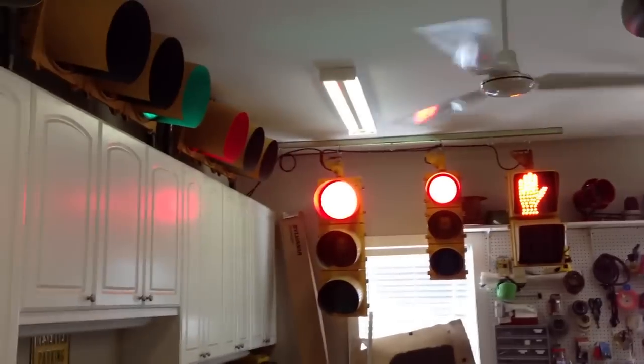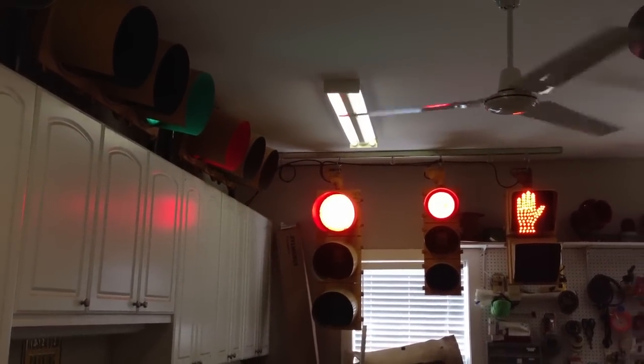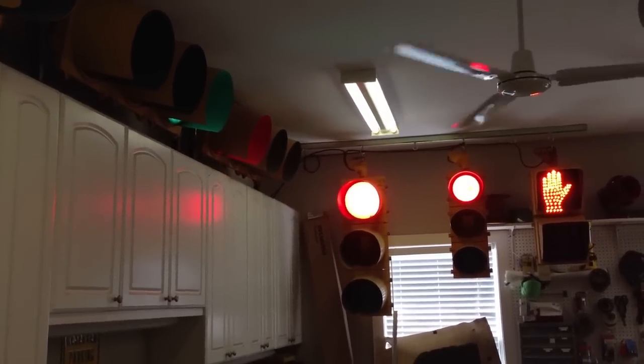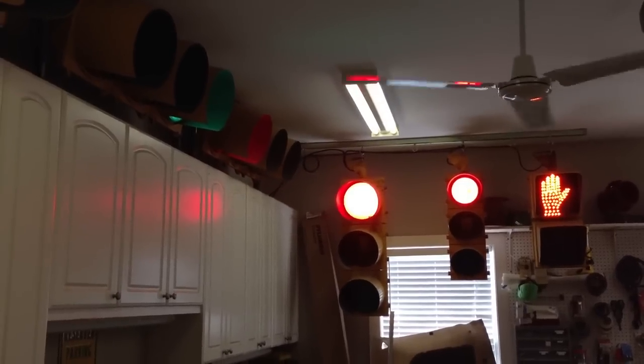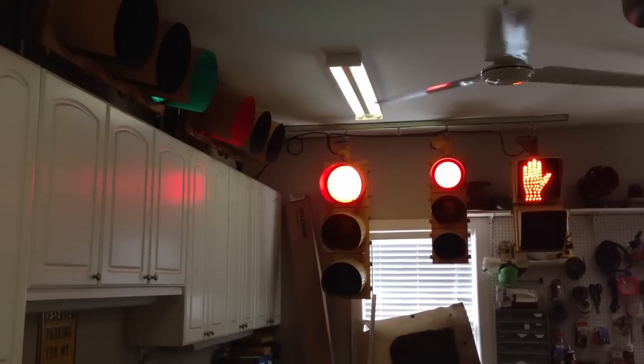All right. I've got another function over here set up. It's a little button. I even got it set up with a sign. This button right here controls that light over there and the one right there above me. Both pedestrian signals. So I'm going to bump this button over here and try to get that other light in the camera view. So here we go. May take a second because it's got a minimum green set up on the other one, meaning that it has to stay green for a certain amount of time, at least.